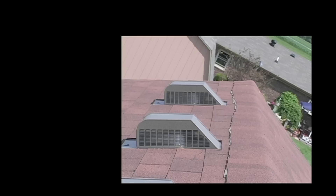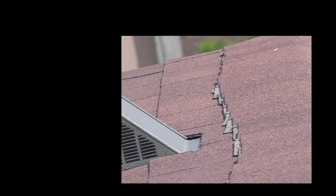It should be obvious that it's just as important to chalk lines when you're installing hip and ridge as it is to chalk lines for valleys, starter, and all the other parts of the roof you can see.